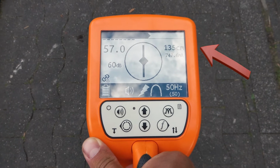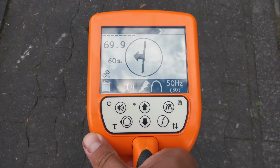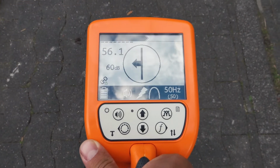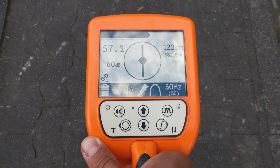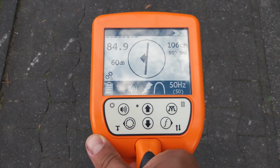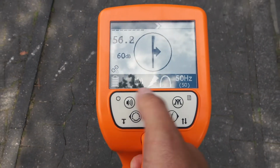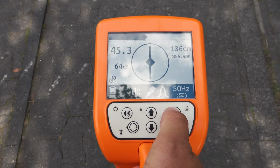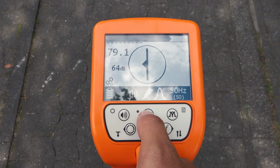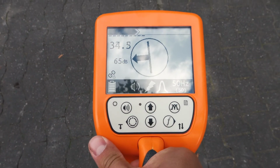In the upper right corner of the display you will now see the depth of the line and the calculated current. The signal and the measured values are in permanent motion. This is because the signal is directly dependent on the load of the cable. If you want to follow the line, we recommend to change the signal behavior to minimum or to maximum narrow. After such change, we adjust the gain according to the new situation.